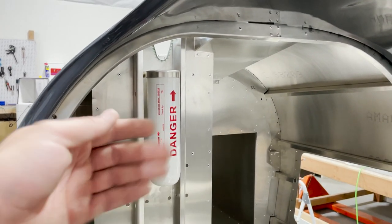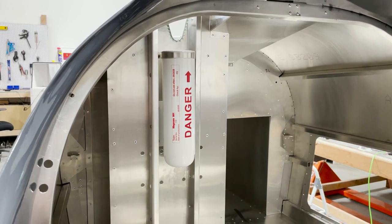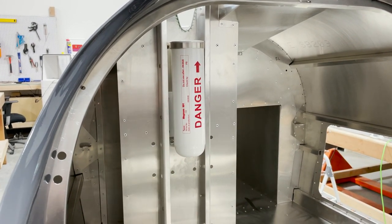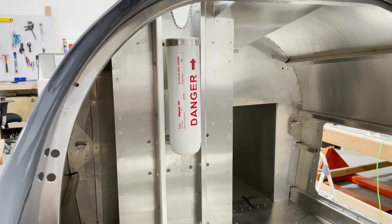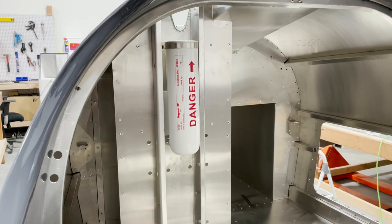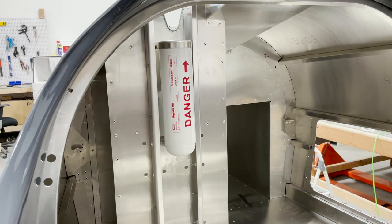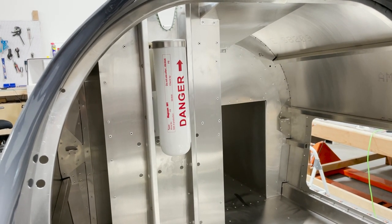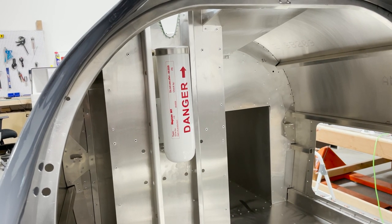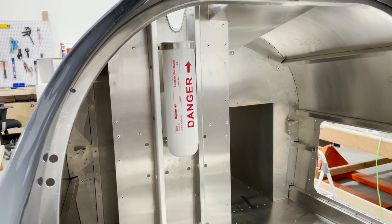Those spacers are important to keep the spacing of the rocket correct in its blowout hole and keep everything straight and well aligned. It is a little tricky to access the washers and the nuts — I find the easiest way is with a very small magnet on an extension stick. The manual says to use tape, which is perfectly acceptable too, but the magnet slides them in there really easily.